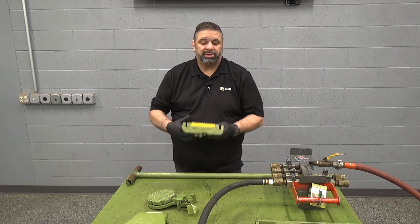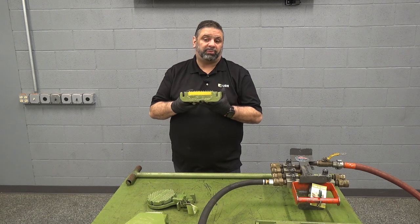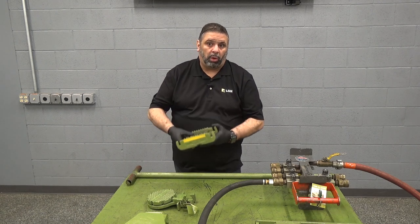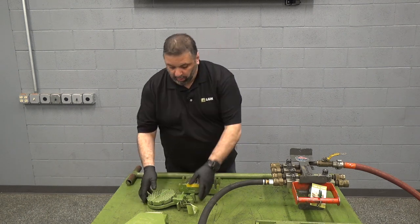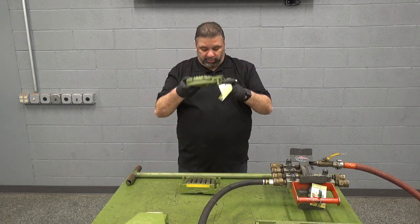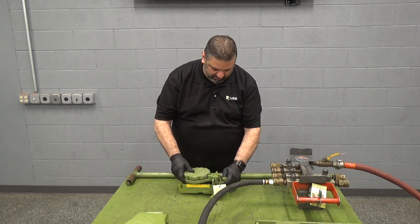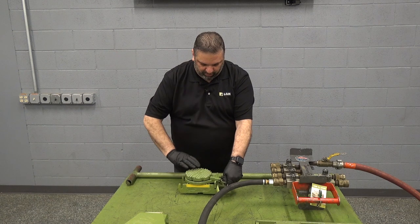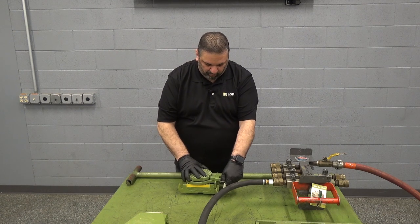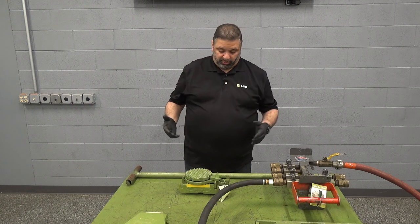In my hands right now is the standard ERS model which comes in three and three-quarter ton all the way out to 25 ton. With the ERS model you're also able to rent the optional turn table which sits in here like this on either side, and when you pull this cotter ring it enables the turn table to rotate to allow you to properly rotate the skate if you have a change of direction.